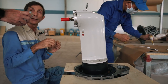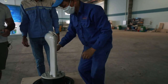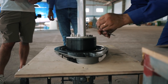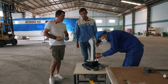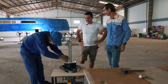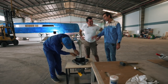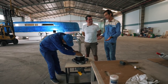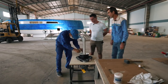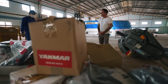You can see this is a pretty long bolt — it has to go all the way down into the body of the frame below. Without the extension it would only be about this long. You need to ring it a little to get those threads aligned. Typically James has Mr. Har tighten the bolts, then double-checks them all with a wrench. Yanmar doesn't specify a torque for these — they have general torque ratings for bolts but not specifically these ones. Just don't overtighten them.